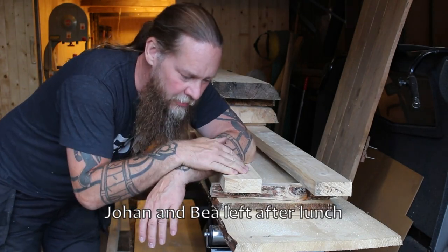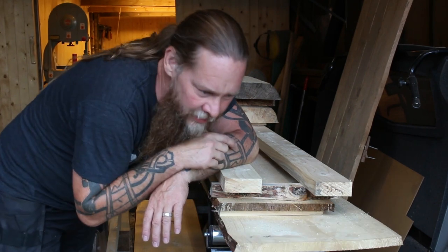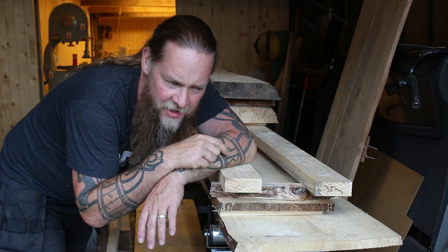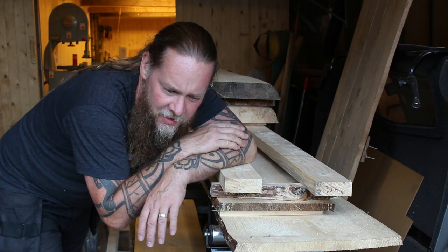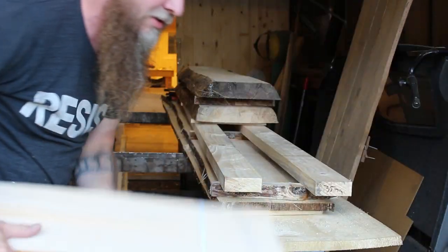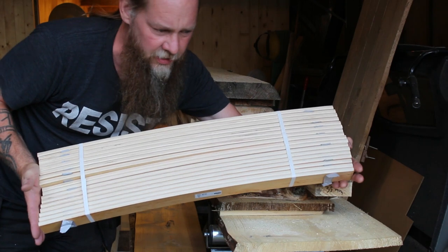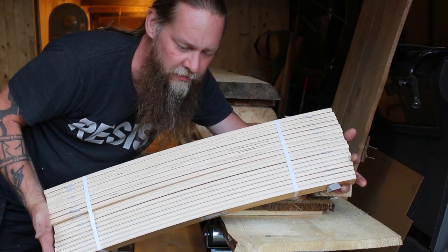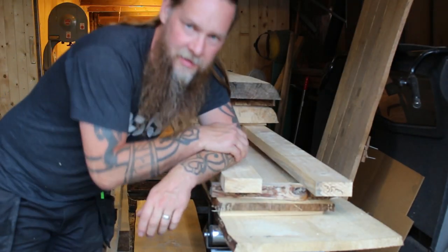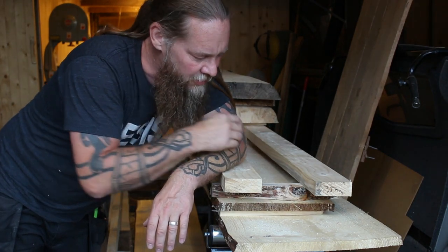Now for the cutouts along the sides. Before I can do that, I have to determine where the support beams for the mattress and the rib bottom that supports that will be put on the inside of the side planks. And because the ribs that will support the mattress are in two halves, 70 centimeters wide, and the mattress's total width is 142. Because of that, I need a central beam, and I would have put it there anyway, even if I had ribs that were 142 long.